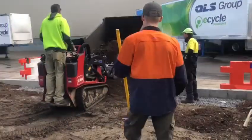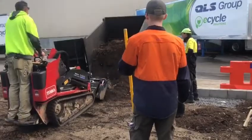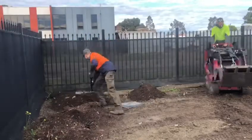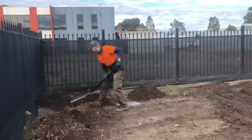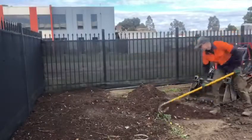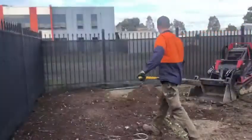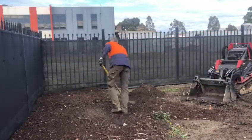Our compost is a mixture of dirt, sand, and organic matter left over from the excavation for the retaining wall, as well as finely mulched brush from tree work that was also done on site. A good seed bed is 3 to 4 inches thick. It consists of a sub-base primarily composed of sand, compost, and black dirt.